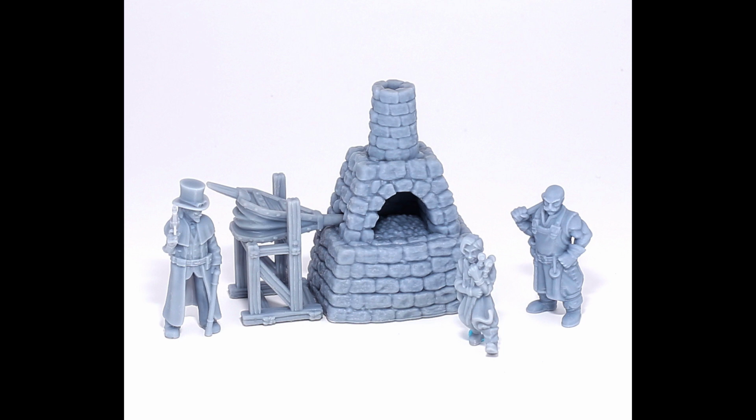Unfortunately or fortunately, my support settings will expose if your resin settings aren't right, because those ultralight supports, as you can see, if your resin settings aren't perfect, basically, those supports probably will just fail. So if my supports aren't working for you for some reason, it might be an indicator of another problem, which is your resin settings. So you might want to play around with that and see how your results are. So hopefully this helps you a little bit, gives you some insight.